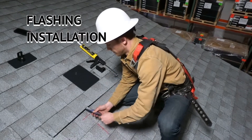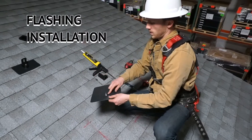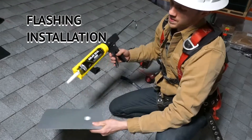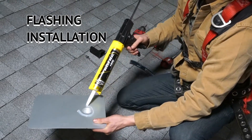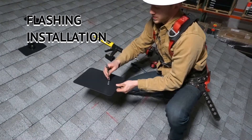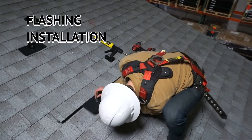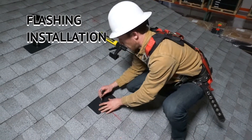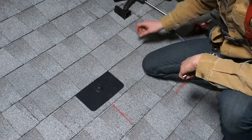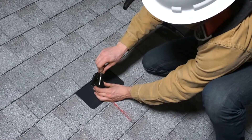I'm going to gently lift the shingle. I'm going to take the flashing with the elevated water seal and add additional heavy-duty roof cement to the back of it right around where we're going to make the connection point. I'm going to use the lag to line up with the pilot hole, placing the flashing underneath the shingle to have it act as an additional shingle. You lay the L-foot on top of the connection point.